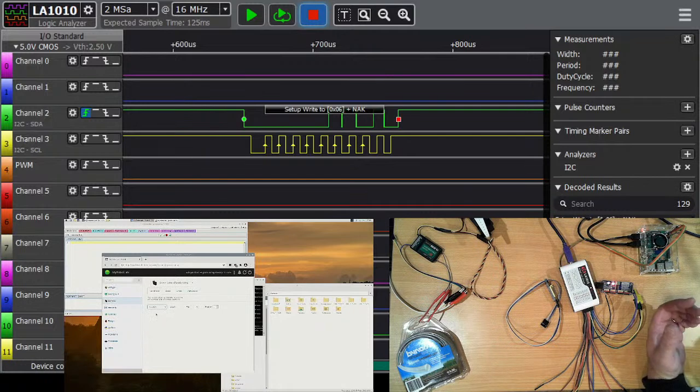If you have multiple PCA9685 services created, and you do need one for each one that you use, or if you have some Arduinos connected, they will all appear in this list. You need to specify the pin you're going to be connecting to. So I'm going to connect to pin 0 at this time, and then we can attach it.